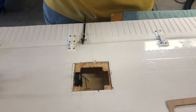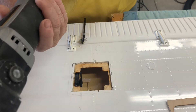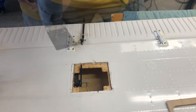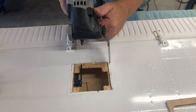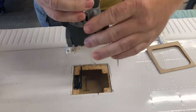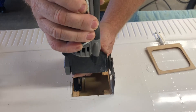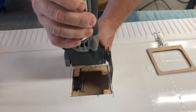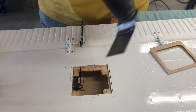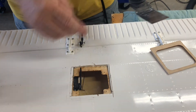Let's get some of these pieces out. What I use to cut that with is the old-fashioned Dremel tool — works great. Slow speed cuts the skin really fast. Here we go — you can just go a little slow. Now when you're using this, because it's a soft material, you'll know when you hit through it — you'll feel it go through, so you don't have to worry about cutting through that material.